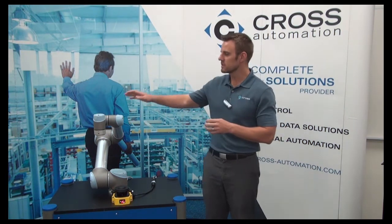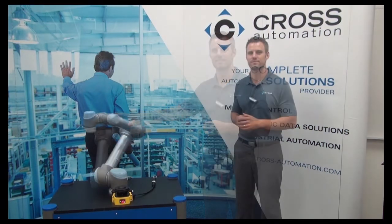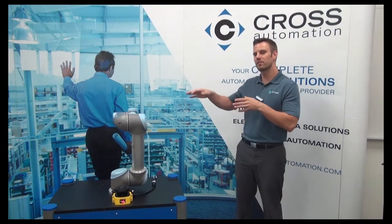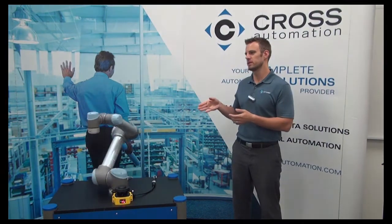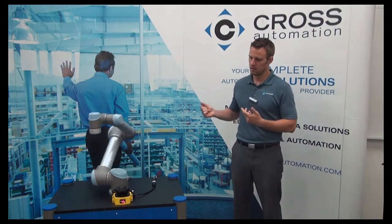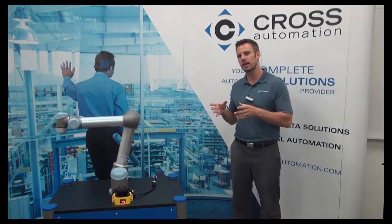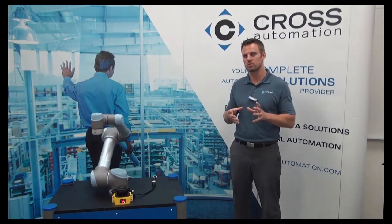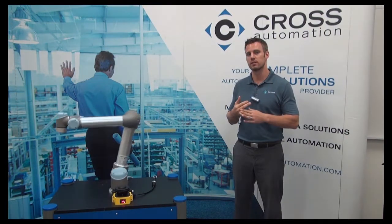In production, this could really be custom fit within any range of the scanner. So let's get this robot going and let you see it in action. As you can see, the robot is operating at normal speed — there's no specific pattern between these points, just three random points in space for the purposes of the demo. We've set up the area scanner with a couple of zones that are going to trigger a reduced speed mode and then a safeguard stop within the robot.